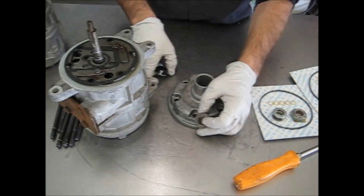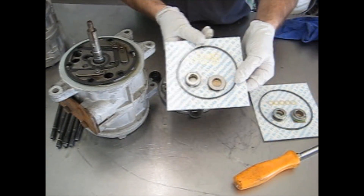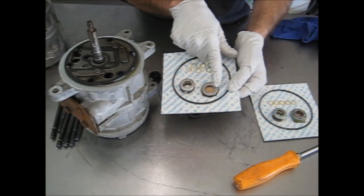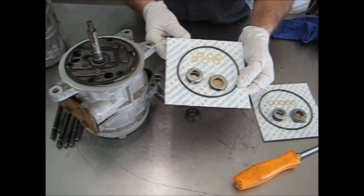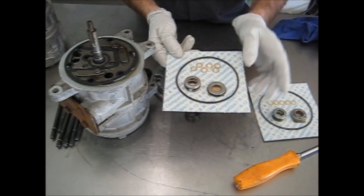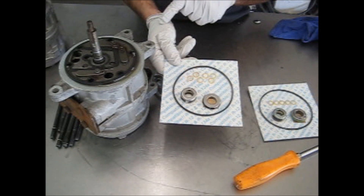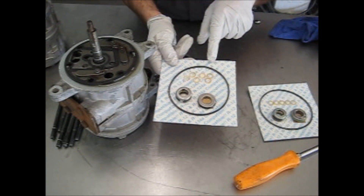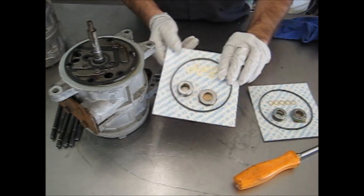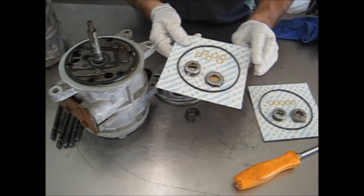To replace these seals, get your package of seals. You'll notice this one does not have the extractor ring, so this one fits this type of compressor. If you're in doubt as to which type of seal you need — front or back loading — this back type seal will fit both compressors; you just lose the extractor part. This seal is our part number SK753N.